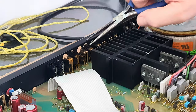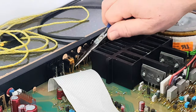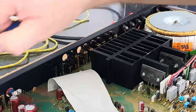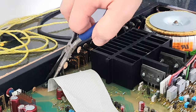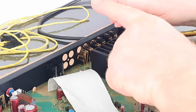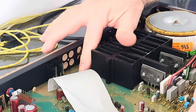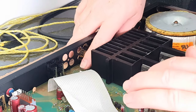If they're not free, simply repeat the process. If you've successfully wicked away all the solder the joint ought to come free very easily. With the amp the right way up again, use a fine-nose pair of pliers and remove the original connector — the legs should pretty much lift straight out. Don't forget to retrieve all the tiny little bits of plastic. To make sure I've cleared the holes so the new legs can go in, I wipe my soldering iron on one of the old legs to clear it and just use this to poke through each hole, using a licked finger, a cloth, or maybe even a mini vacuum.